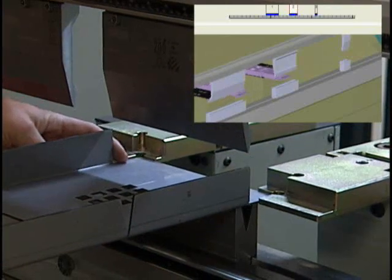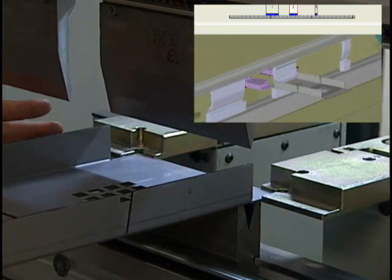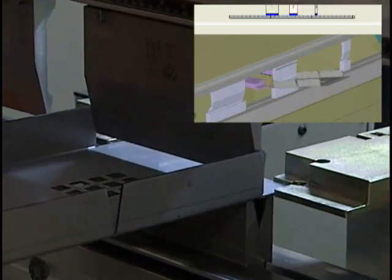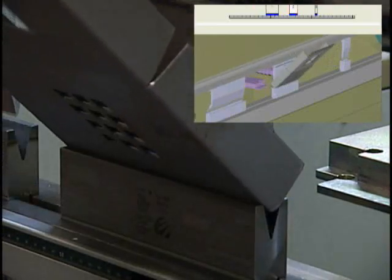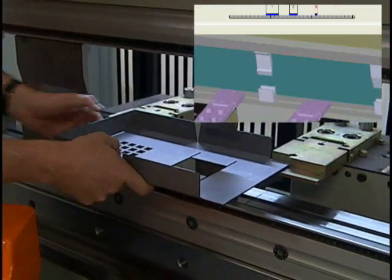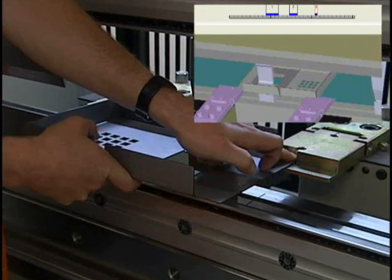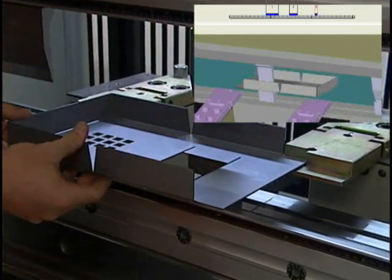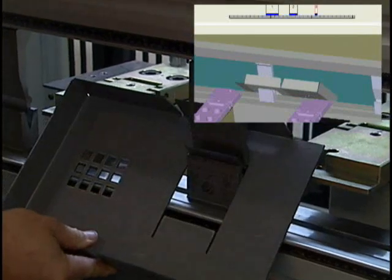Among the key features of the 6-axis gauge are corner gauging, allowing the gauge to ensure alignment of the part and tooling in critical situations. Additionally, when required, the gauge can skew, allowing you to gauge from a formed and an unformed flange and achieve critical alignments.